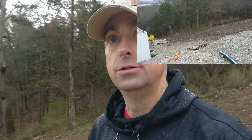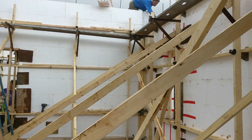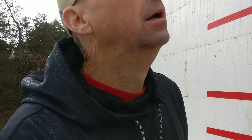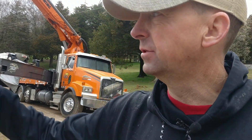Down here, John the operator has his remote and will honk the horn when he's done pumping so the truck doesn't overflow the hopper. They're starting at the bottom and working their way around. You can see it started to fill up in there. They started mostly in the corners, filling up the foundation parts, and then just keep working themselves around and around.